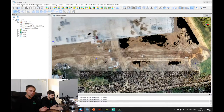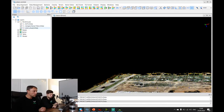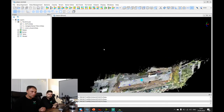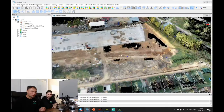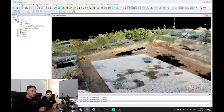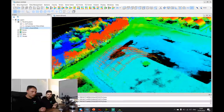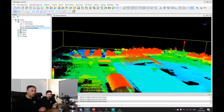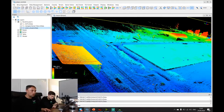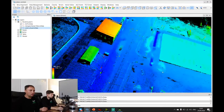And let's look at this section in a three-dimensional model. As you can see, do you see on the screen metal parts of the construction, this one? This one. So all metal parts of the construction were surveyed as well. And you don't need to use any special techniques to measure it. And all power line poles or light poles were measured, and all concrete was measured, and the border of the roof was measured. So everything was measured, and you will create a very precise three-dimensional map